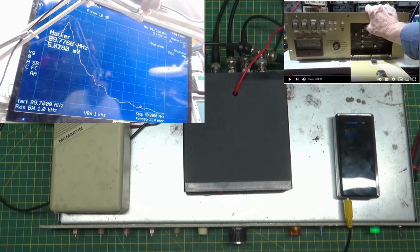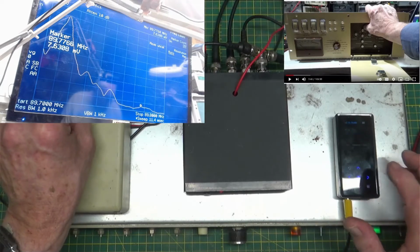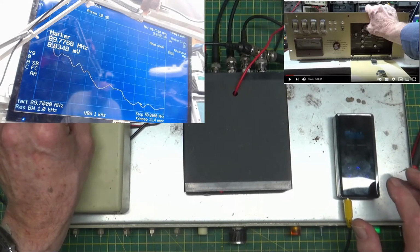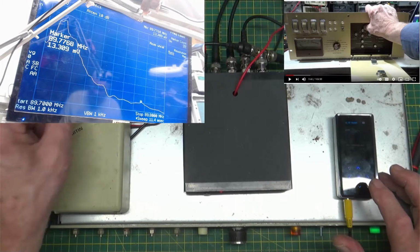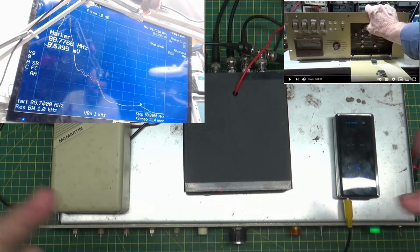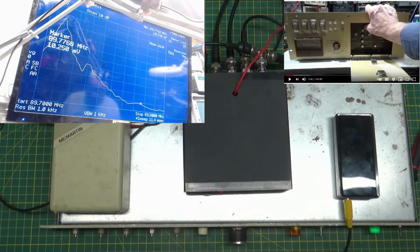Now I want you to hear this, and you're always going to get this no matter how careful you are. You can hear that. Let me give it a little bumping. That's bleed over from the main channel. So let's take that down there. You're always going to get a little bit of that. There's not much you can do about it. It's going to be there, because the receiver has a lot to do with it, and the transmitter has a lot to do with it, how well it's going to reject it.